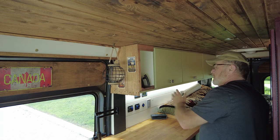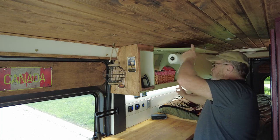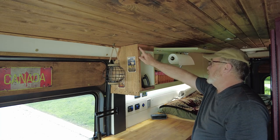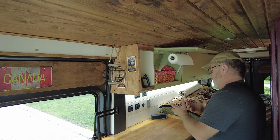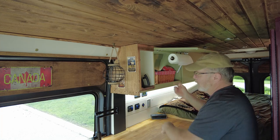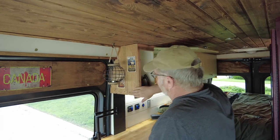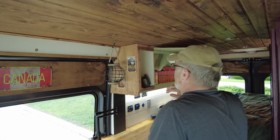and make adjustments on this final end panel. Now, the other thing that you may notice is that this board, obviously on the front and this one, they go right to the very end. But when you build something like this, the way it was set up was, what I'm going to have showing is the end grain here. So what I did was I faced it with this pine to give the finished look and kind of cover that end.